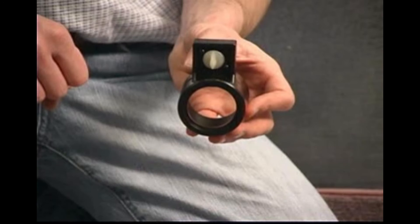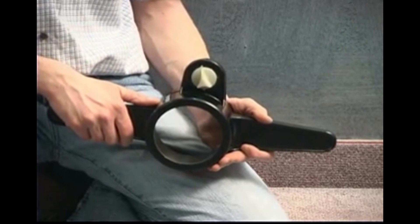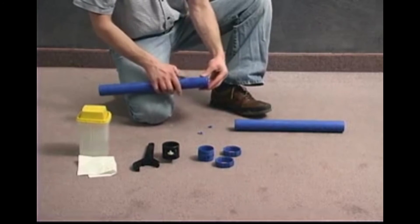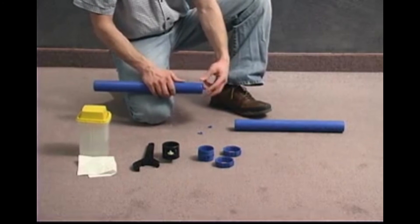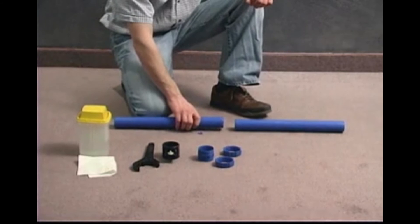The 1.5 inch and 2 inch grooving tools are designed for single-handed use. The 3 inch and 4 inch grooving tools, as seen here, are designed for two-handed use. Any material left as a feather edge in the groove should be removed. Care should be taken not to damage the square end of the groove, particularly at the edge near the spigot end of the pipe, as this is the primary sealing surface. Feathered or rounded edges may indicate a worn tool and possible leakage. Make sure the groove shoulders are sharp.